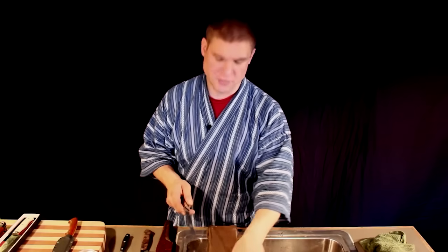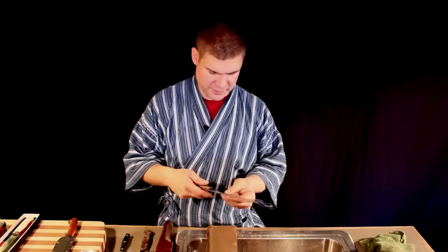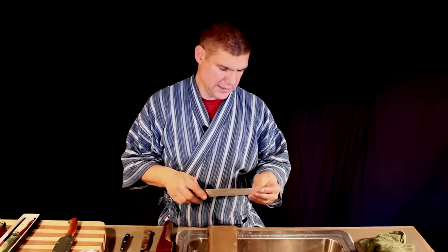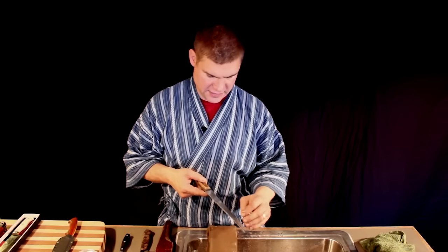So that's step 2, straightening the blade. Now, step 3. Step 3 is assessing what needs to be done to the blade. As I've already mentioned, almost all blades that you're going to run across in North America can use a good thinning out in cross-section. That's going to involve grinding away some of the secondary edge.